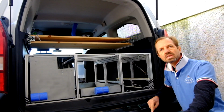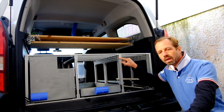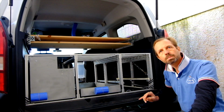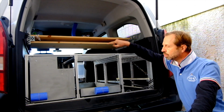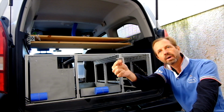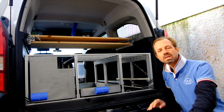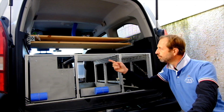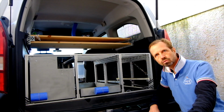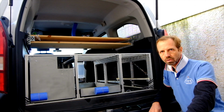In the transversal direction, I use L-shaped mounting brackets, these here, to keep the tunnels for the drawers as open as possible. While in the longitudinal direction, I use the stronger triangular mounting brackets. From an assembly point of view, this makes no difference. Just insert the sliding block in the groove and block the bracket in the correct position with the screwdriver. Don't forget to reduce the torque of the electric screwdriver.